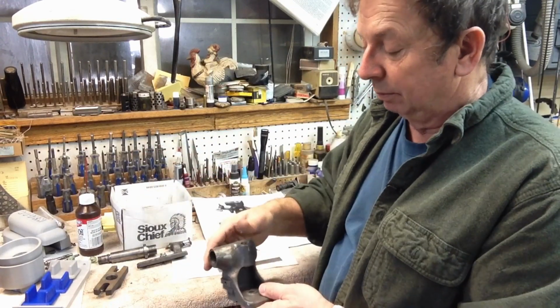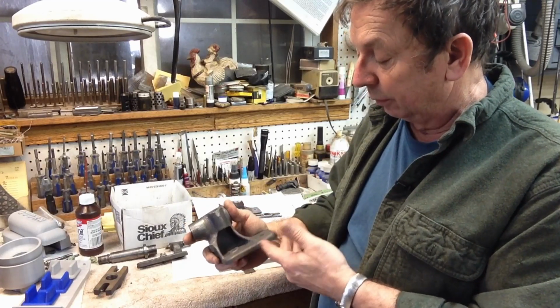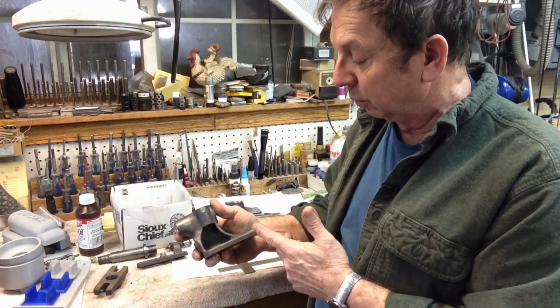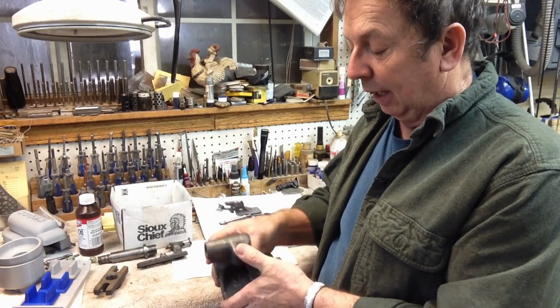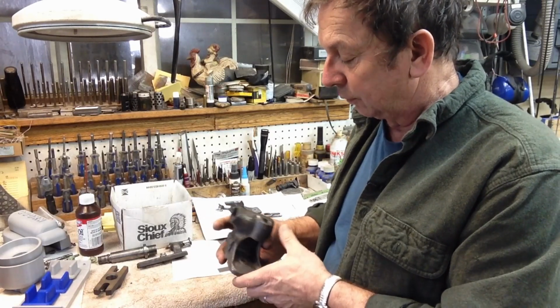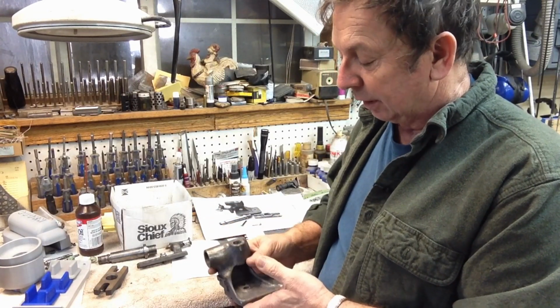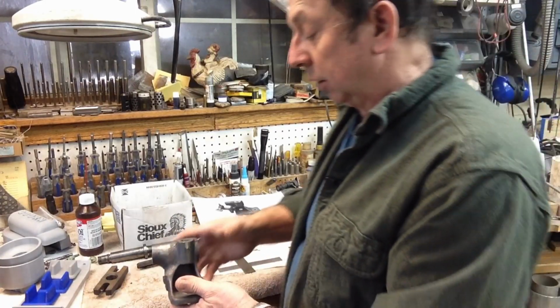And the way I'm probably going to cast this, and this will be the tailstock end, although if we do patterns for the headstock too, I'll do them the same way, is they'll be cast in this position, and we'll probably put a core in these, so we'll have to build a core box for them. We'll leave them oversized, but it's relatively straightforward and basically a mirrored dimension on the other side.